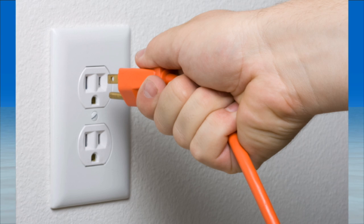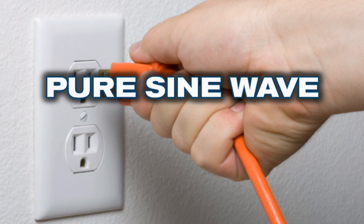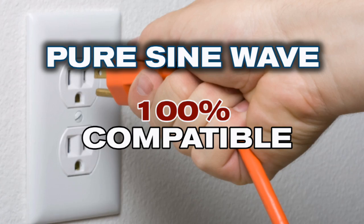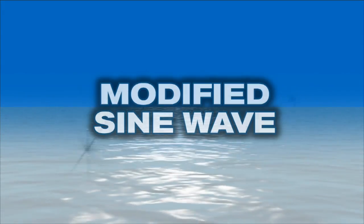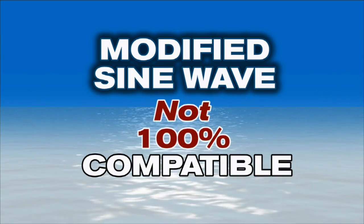But what's this talk about modified sine wave and pure sine wave inverters — which one should I buy? I have to warn you that this part gets a little technical, and for most boaters it doesn't make a ton of difference. Pure sine wave AC power is what you get when you plug an appliance into a wall outlet at home, at work, or into a quality generator — it's 100% compatible with anything on your boat. Modified sine wave, sometimes called quasi sine wave, is a bit of a shortcut. The majority of appliances will work fine with it, but certain loads like sensitive audio equipment, laser printers, and some light dimmers do not work well. The best choice is to go with pure sine wave inverters, but they generally cost more per watt.